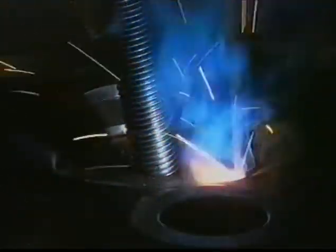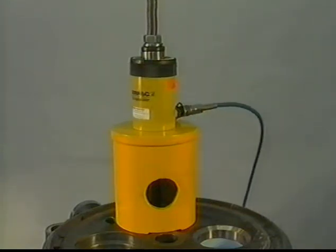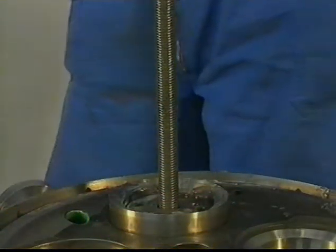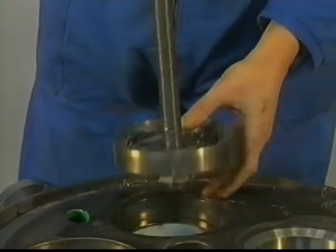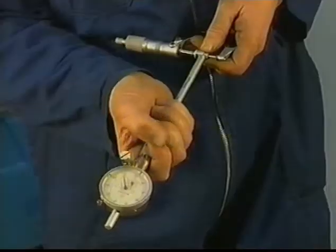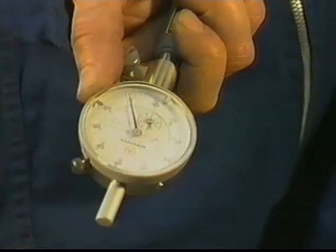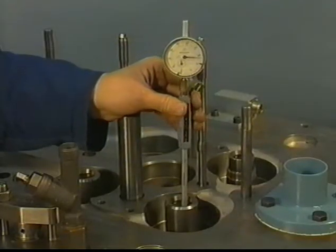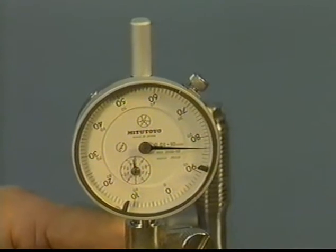The inlet valve seat can be removed in the same way. Due to the bigger inner diameter of the inlet valve seat, a bigger disc is needed. Measure the inner diameter of the valve guides. Always first calibrate the measuring tool. In case the diameter is out of limit, the guides can be removed in the following way.